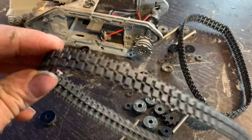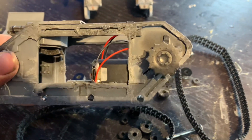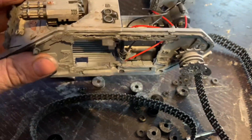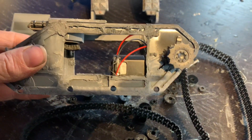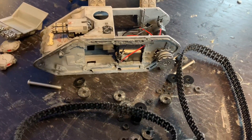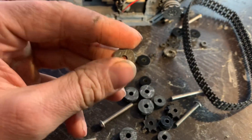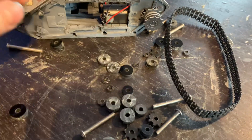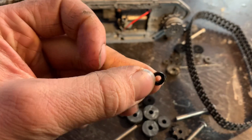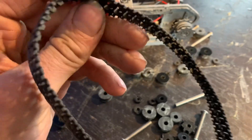You can see the nice rubber tracks going on the sprocket. I did have to lower the sprocket so the tracks were still the right length inside, so it's not quite in the top corner like it should be. I also had to cut out all of the sides internally to make sure it's smooth enough and clear enough for track clearance on the inside. For the actual road wheels, I got some plastic acrylic and CNC machined some circles, then CNC'd some little circles for the spacers to run in between the track lines on the teeth on the inside of the tracks.